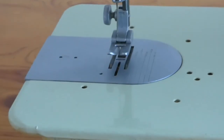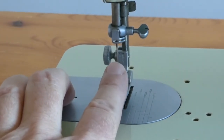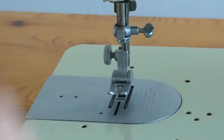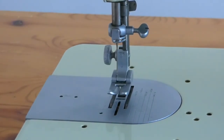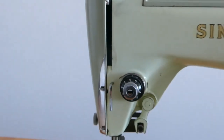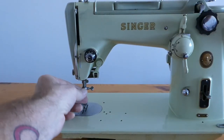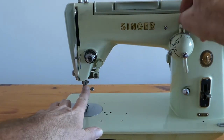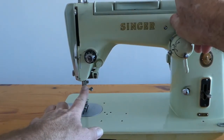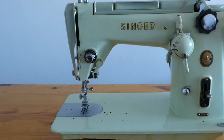Maybe that's a better way to look at it. There's the needle. Did you see that? If you look at the needle bar, you can watch it go left, center, right. To give you the big picture — watch my finger down here on the left, and there's my hand adjusting it. There's center, right, center, left. So you can see that's how you position the needle — center, left, or right.